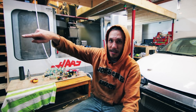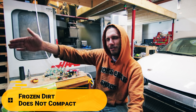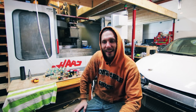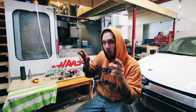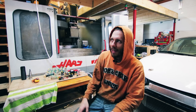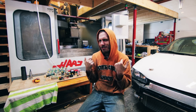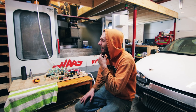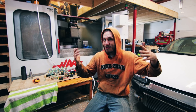Right as I started trenching there was a storm warning — it was supposed to be minus 10 Celsius right away. I had to get all of that stuff in the ground before the ground froze. The trencher was a very used one, quite the learning curve. I trenched all the way over, then flipped it around and trenched it back. The machine ran out of oil halfway. The real problem was getting that warm dirt back in the hole before it froze. I packed it pretty good but I'd put it at probably 20% real compaction — I'll deal with that in the spring.